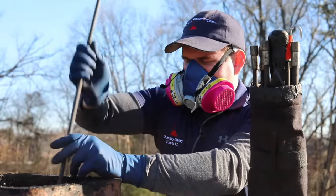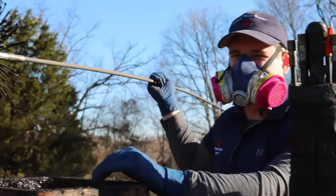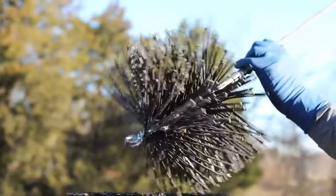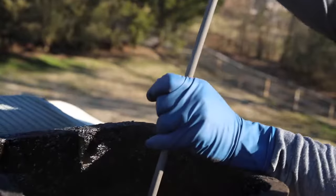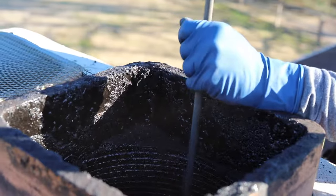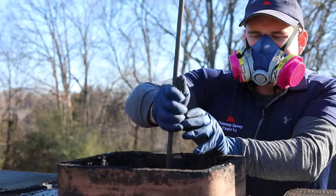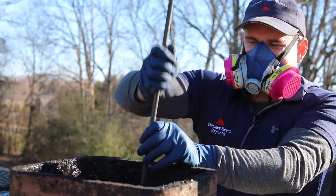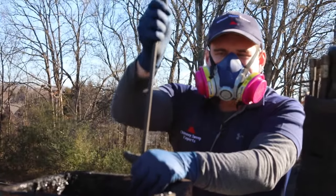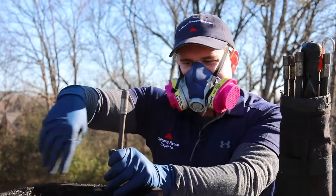What we're doing is running a brush that's the same diameter or a little bit bigger than the diameter of the flue liner. In this case, it's a round flue liner. So we're going to use the brush to scrub off all of the soot covering the side of the liner. At the bottom, the wood stove is still inside the fireplace, so none of this soot falling down is going to get inside the house. Once we finish up with this, we'll go inside, pull the wood stove out, get the drop cloth down and the vacuum cleaner, and suck up everything that's been swept down.